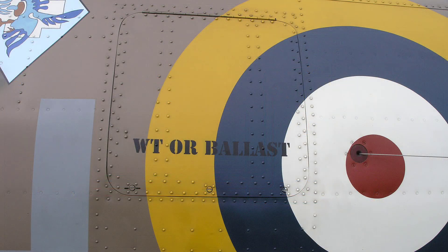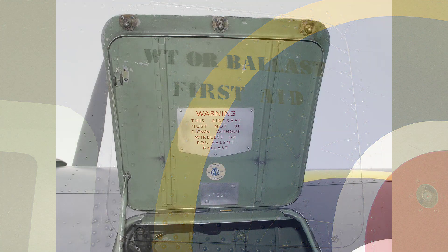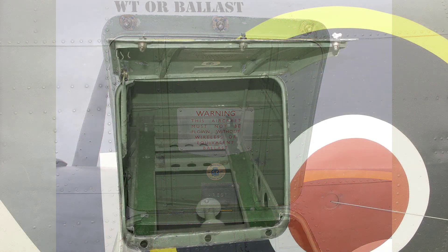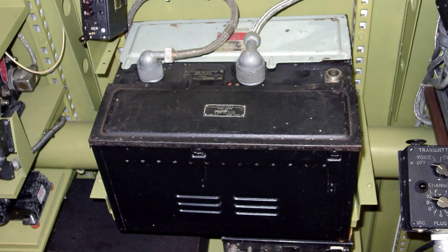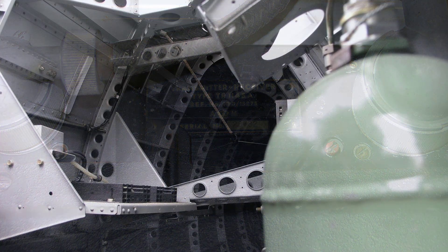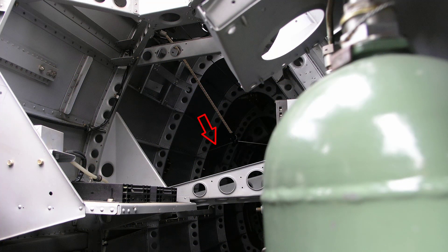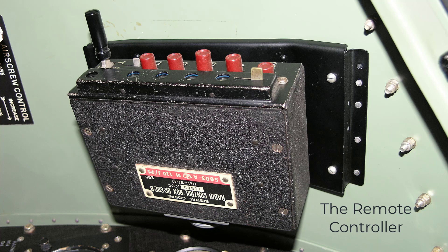Wireless stowage access is gained through a door fitted on the port side of the fuselage. Here is a view of the wireless stowage tray. The TR1143 transmitter receiver is mounted on a tray which is similar to and interchangeable with that of the TR9D unit. The unit is attached to four shock absorbers by means of the bolts and check washers which are used to secure it to the transit case. A push button electrical control unit is mounted on a base plate which is interchangeable with the plate for the mechanical remote control of the TR9D.